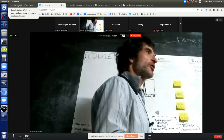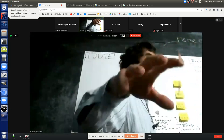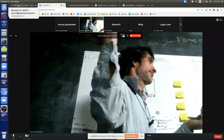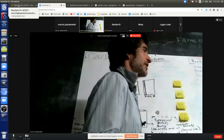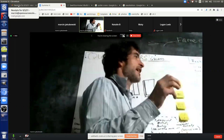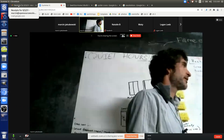What if we just lay the joists up on the second story platform? Don't even worry about the cutout for the stairway, because we're doing a stairway in the other place. So okay, what are the advantages and disadvantages? The advantages are that getting the joists up there is going to be really quick, whereas if you do the cutout, you have to cut out a bunch more and shorten the other ones. A little bit of thinking and stuff there.